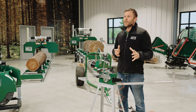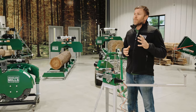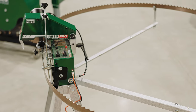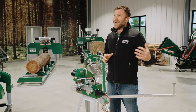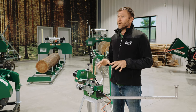A lot of sawmill owners consider buying a blade sharpener for three main reasons. The first is extending the life of the blades you own — with an average resharpening of five times per blade, you can take a 10-pack of blades and get 50 fresh starts. The next reason is convenience, knowing you have sharp blades when and where you need them. The third reason, possible with the RS30 Pro and its under seven-minute cycle time, is offering a sharpening service for hire within your community to see a further return on owning the blade sharpener.